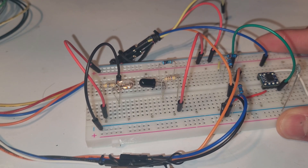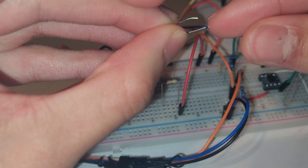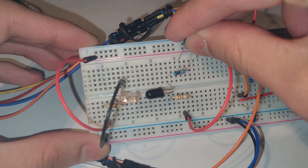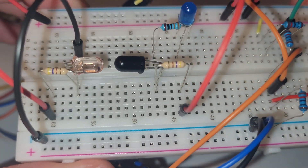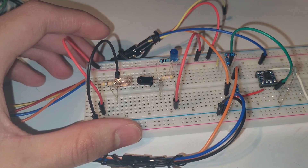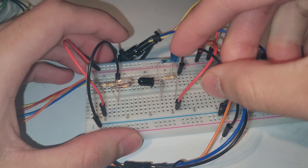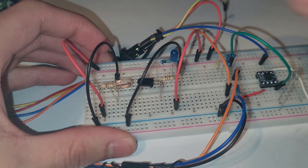We're powering through here into the phototransistor, and then it goes through this resistor to power the LED. The positive side is the longer lead — we're going to take it and plug the longer lead into the same column as the resistor, so it looks like that. Then we need to ground the LED, so we're going to take this wire and plug it into the same column as the cathode, then into ground.